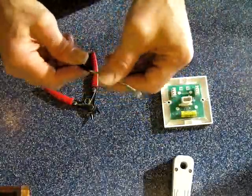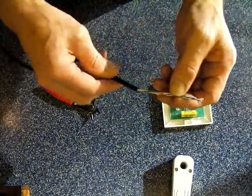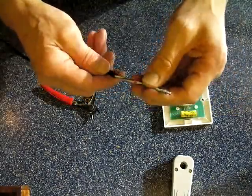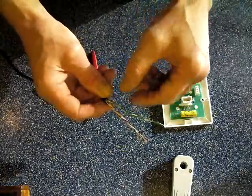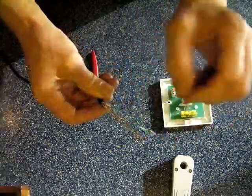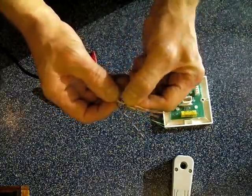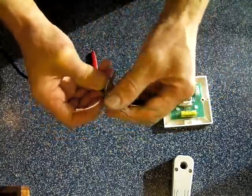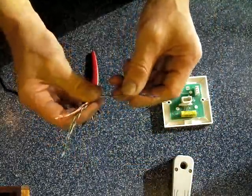This cable is external telecom cable — it's black, but it could be white, it could be anything, it could be data cable. But you've generally got four pairs in it, or three pairs, which go blue and white, orange and white, green and white, and brown and white. The cable almost always terminates on the white-blue pair, which is the first pair.